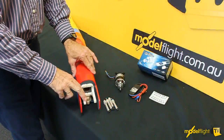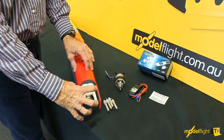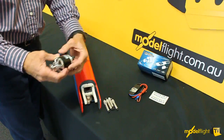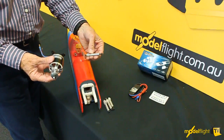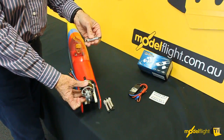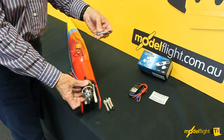The Seagull 40 comes with the radial mount, as we showed before. First part of the process would be to remove that, so it's just the 4 bolts here that will come off. We're going to set the Dualsky motor up with the rear mount option. It can be configured either way, but we've put the cross mount on the back, prop driver on the front. Dualsky make a series of motor extension pieces, so you need to measure how far forward we need to move the motor and buy suitable standoffs, which Dualsky do in 10mm increments. So these are actually a fraction long for the job at hand, but it's indicative of what we'll do.